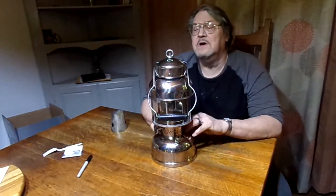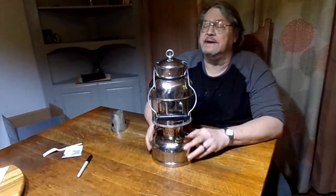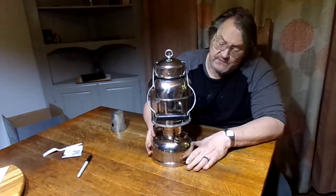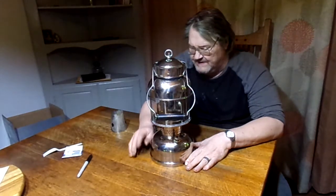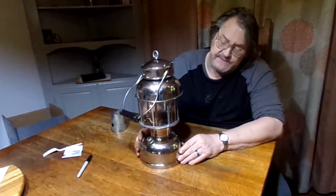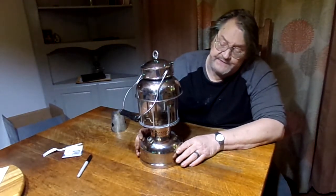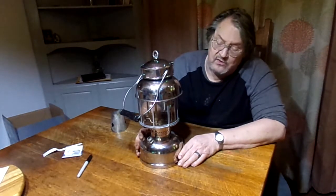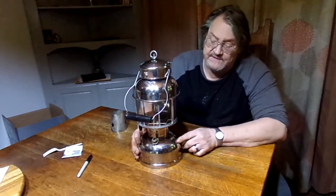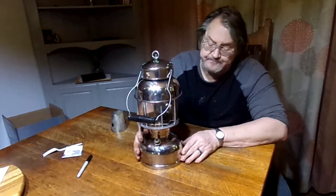It looks pretty good. I stripped off all the original nickel, even a copper base coat — plated copper base coat — and gave it all a fresh nickel plate, so it's looking nice and bright and shiny. The only thing I wasn't a hundred percent happy with was there's one spot here where they had the big dent. I was not able to pull the dent completely out, so I filled the rest in with pewter and plated over that. There's just a little bit of a murmur in the plating — unless you're looking for it you can't see it, but if you look for it you can tell something happened there.